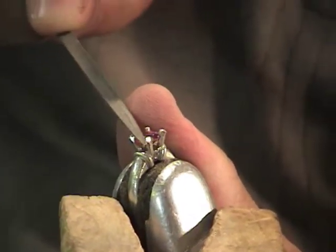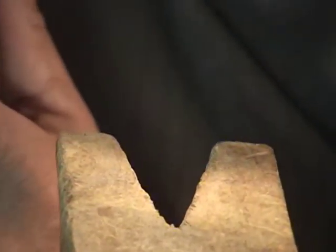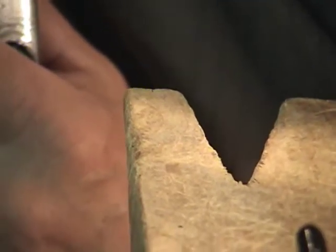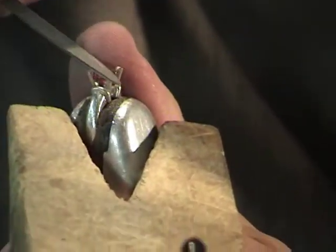Has the stone side got a safety side? The file is worn down. Right. That's going to be resting on the stone. It's not going to endanger the stone. If you're going to be using a new file, doing this process, I suggest using paper emery disc, which I've given you, and just remove that sharp edge where the teeth will be, so you make it a safety edge. On the file. Yes, ma'am.